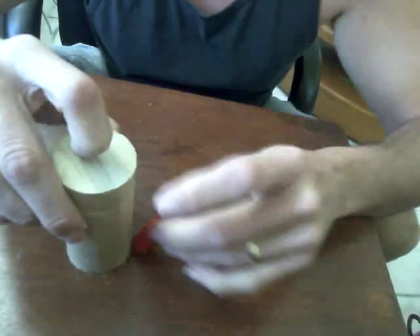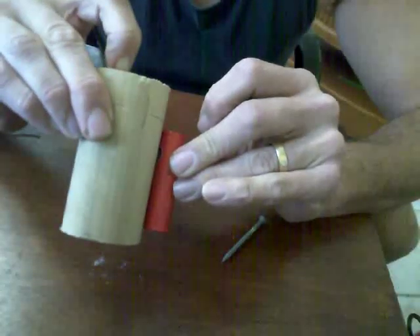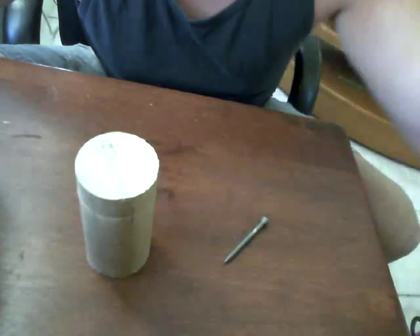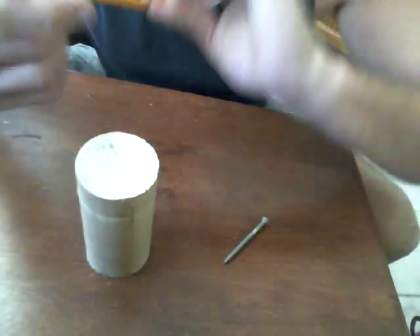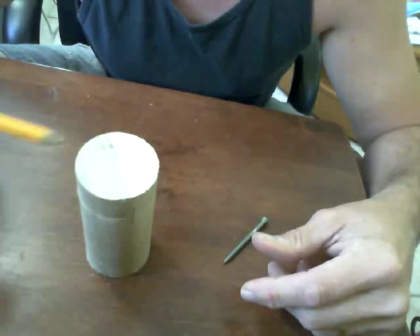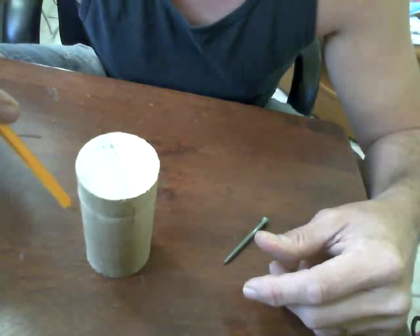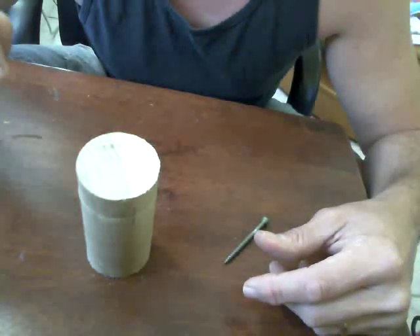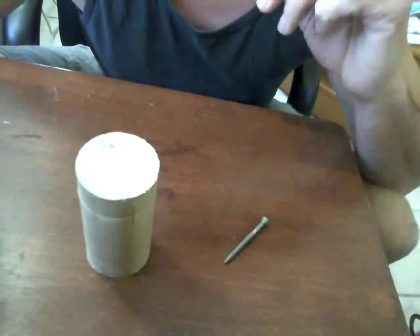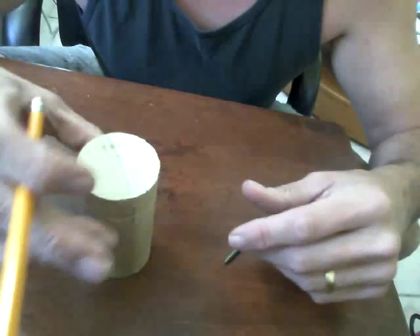You can see how much room there is in the battery chamber - it's actually much larger than it needs to be, but once you shape and sand the pipe you can refine it. Next thing you need to do is drill a pilot hole. This pilot hole is going to guide you from the top all the way to the bottom with everything that you do - from the hole on the top where your button is, it lines up the inside lid for the button seat and the negative ring connection, and lines it up with the battery chamber. If your pilot hole is not right and not straight, it's not going to come out right. This is probably one of the most crucial points of putting your pipe together.